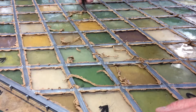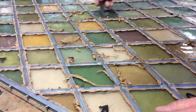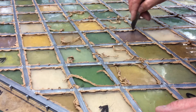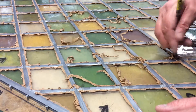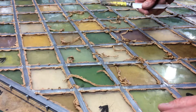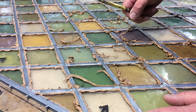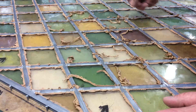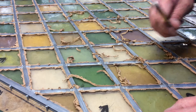These are what we call the lead lines and they should all flow together once the window's in position. Most people don't notice if they're slightly out because the eye has so many lines to look at when looking at a leaded light window like this. So anyway, that's what we call back pointing. When we've got it back pointed, we've got to clean all this off, clean the panel, and then we put what we call tie wires on the panel — but I'll show you that on another video. This will take me the rest of the day to get all this back pointing and cleaned off, so on that note, have a nice day, see you later, bye.